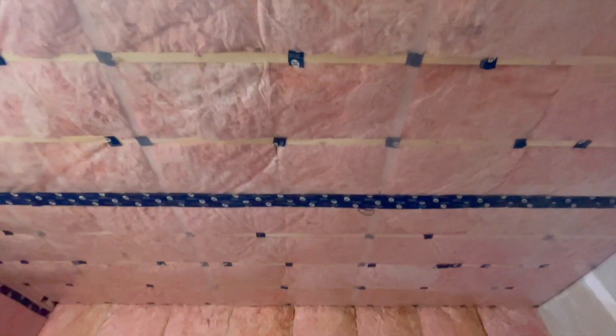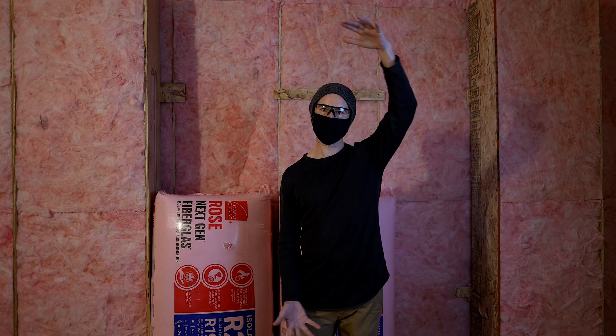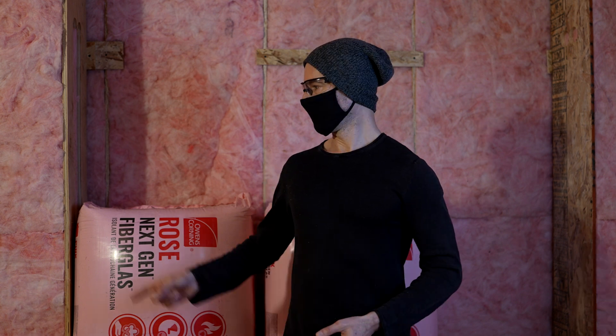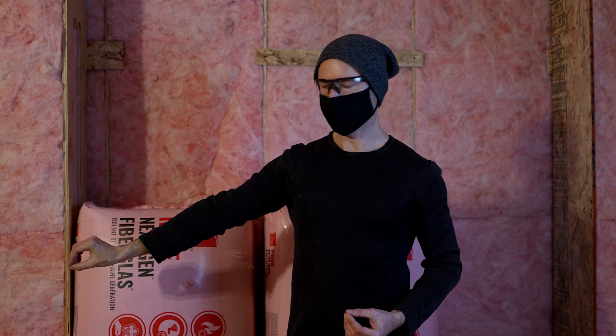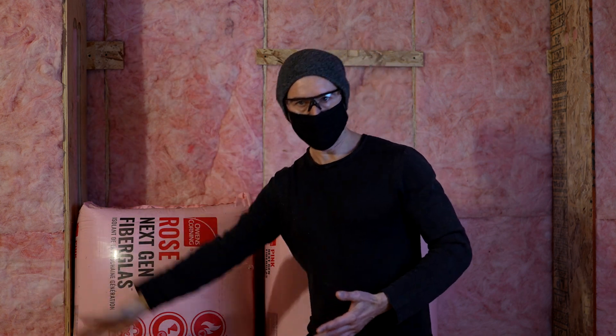The other thing is that this rear trapping is floor to ceiling. In a lot of studios you might see prefabricated or DIY panels that are like four feet tall and you just put them in the middle of your wall. The unfortunate part about those is they do very little below 200 hertz — they're not thick enough, and they don't cover the areas where bass frequencies accumulate the most, which is in the corners of the room. Anytime you have seams joining, that's where they accumulate — where the ceiling meets the back wall and the sidewall, right in that corner, there's a huge amount of bass accumulation, and then down in the bottom corner too. So it makes complete sense to go floor to ceiling because that treats the upper seam, the side seam, the corners, and the bottom seam. Floor to ceiling if you really want optimal acoustics.